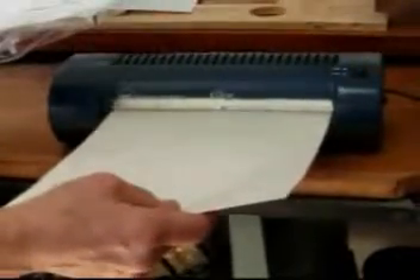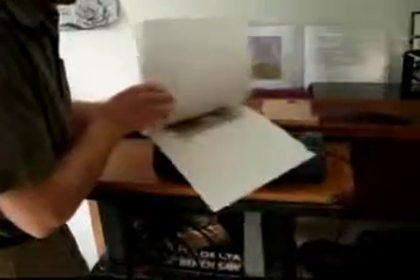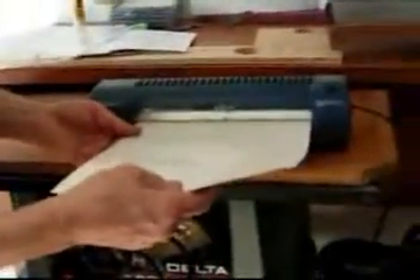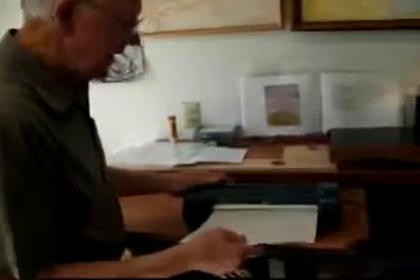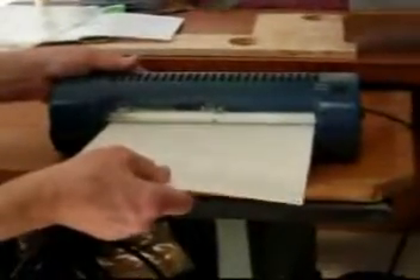This is a very slow stage — it just creeps through at about a snail's pace, or as we say in Seattle, a slug's pace. I like to send it through two times because from experience I've learned it doesn't quite finish laminating in one pass. These machines are not intended for running copper plates through, so the temperature is soaked up tremendously by the copper and you have to run it through at least twice to get a good lamination. Another minute or so will pass while this slowly goes through.